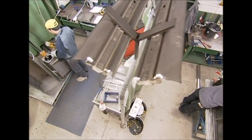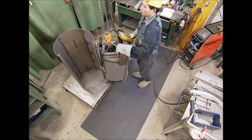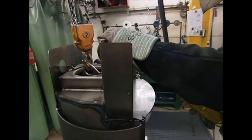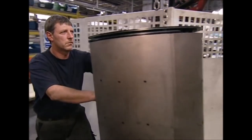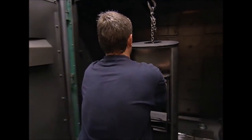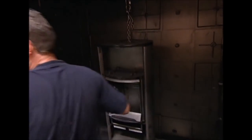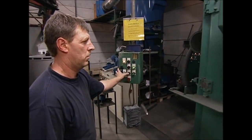This is where the furnace gets put in the shell. Each unit weighs 80 kilos, so to save his back, this man uses a hoist to carry it for him. It's time for some cosmetic work. In this chamber, thousands of tiny steel balls are blasted around the stove for 15 minutes to give it a textured finish.